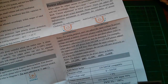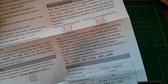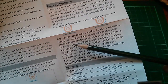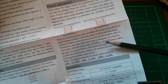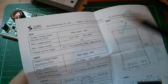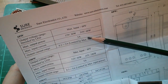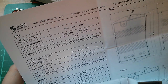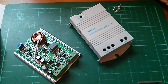I've found an English version of the datasheet and there's a bit of an issue, particularly because I want to drive this from 12 volts. It says: please confirm that both input voltage and input current cannot exceed the specified values, otherwise the LED driver may be damaged. It states a maximum input current of three amps. At 12 volts with three amps, that's only 36 watts of input.